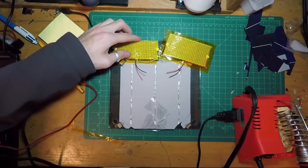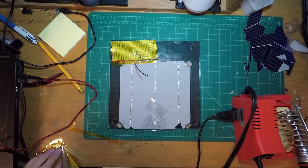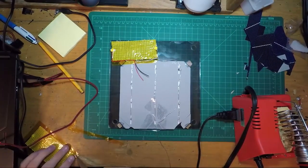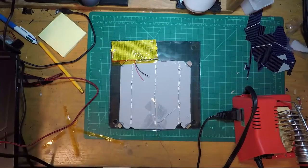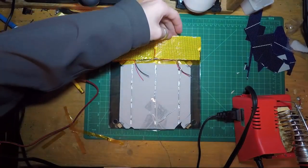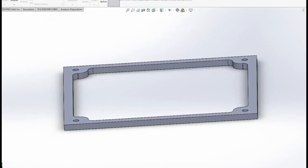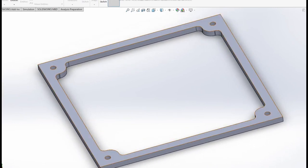Roof heating is another feature we can expect for roof tiles in snowy climates. For this, I simply added some heat pads. I wasn't too worried about where I put the pads, since glass has a high thermal conductivity. The heat will spread over the glass and uniformly melt the snowpack. This gasket I designed allows the panel to be sealed from the elements by another tempered glass panel.